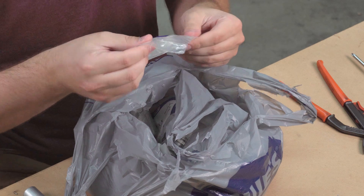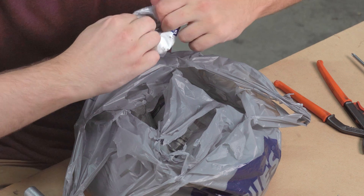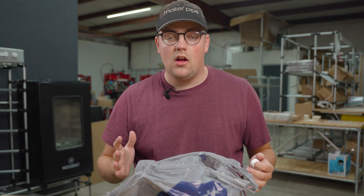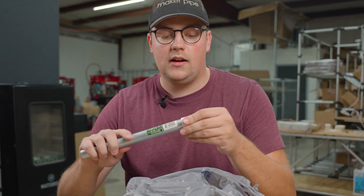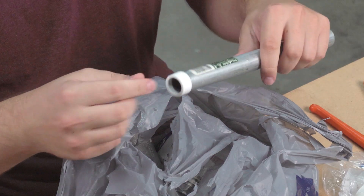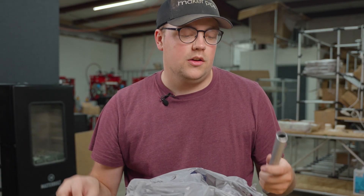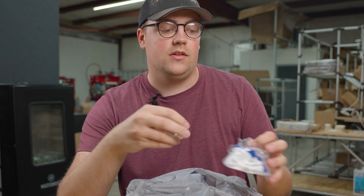Next up are these plastic insulated bushings. These are actually meant to protect the wires when you're running them through the conduit. EMT conduit is meant to protect wires and cables over long distances, and pretty much all of these things are made for specific building codes with the main purpose of protecting wires. These just slide on the ends of conduit. Whenever you're running cables through, this bushing helps protect the cables and keeps them from getting caught on the edge of the conduit and cutting into the wires. They're really inexpensive but have a specific purpose: protecting the wires on the ends and making it easier to slide cables through.